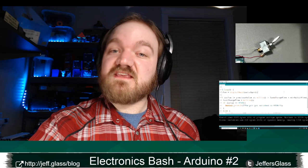Yeah, mm-hmm. This is just another way of, right, because I could have seen an input and then delayed for 100 milliseconds, right? That would be one way of not accepting another input. But again, the further we get away from this delay function into using this millis function and thinking about time, the more we're going to allow our code to do.